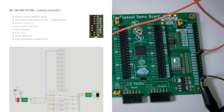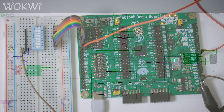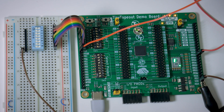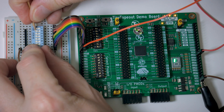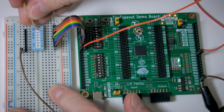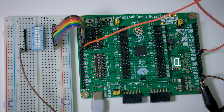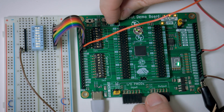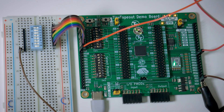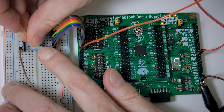Next up, it's design 28, Loading Animation. This design is one of many on the chip that was drawn out as a schematic using Wokwi, so you can easily go and simulate it yourself online. I've started up my slow clock at full speed this time — the fixed appearance of the GPIO LED is a clue of that. This design uses a negative reset on IN1, so we switch it high to let the design run, and an LED segment slowly makes its way around the display. If we switch on IN2, this actually disables the design's own clock divider, which means it's running too fast to be seen. By flipping a couple of the higher input switches and toggling the slow clock enable jumper, we can see the effect at more sensible speeds — slow at about 12.5Hz, then a little faster at 18.7Hz, and a fair bit faster at 35.7Hz.